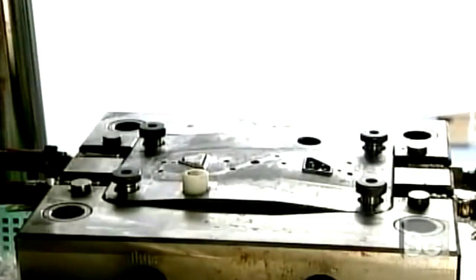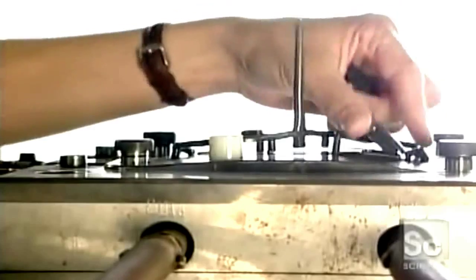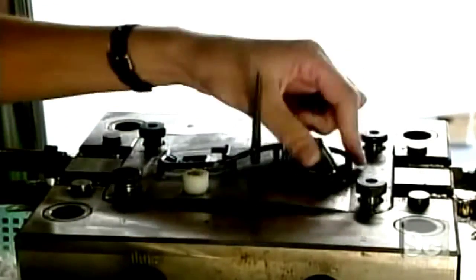Here's a different molding method. A two-step process they're using to make buttons that go on the steering handle of a jet ski. First, they mold a structural base out of hard white plastic. Then they put the base into a second mold and inject a rubber-like gray plastic. This softer plastic covers everything but the raised lettering, giving the button a softer feel.